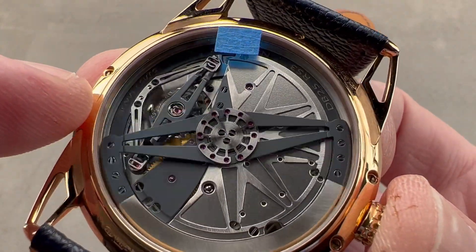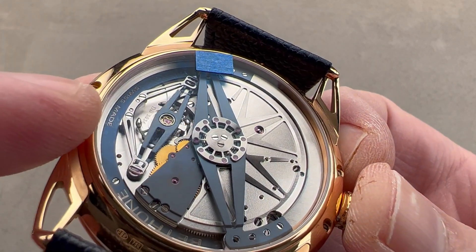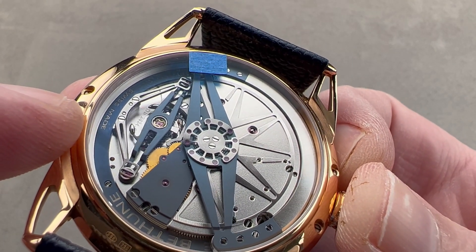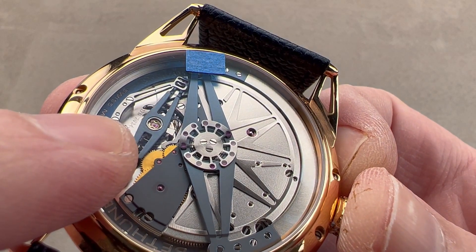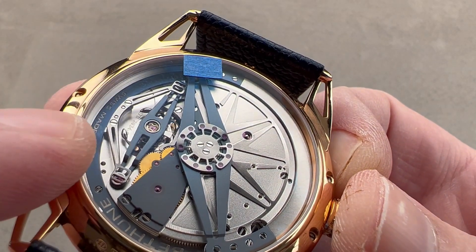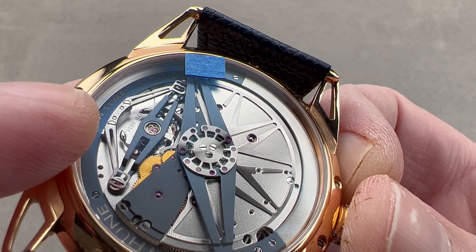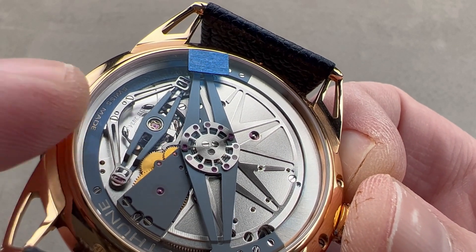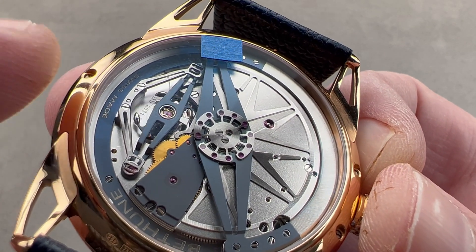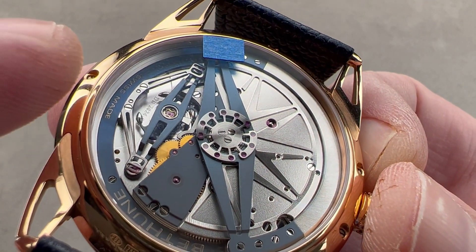We have more of the fired blue titanium on the reverse side. We have three shock protection springs on the balance — that's called triple parachute. It's there for the sake of chronometry as well as shock resistance. Most watches feature shock protection for durability alone, but here Denis recognizes that the faster you can reseat the balance staff pivot in its jewel cup, the faster the watch may resume keeping good time. So this is here to rapidly recenter the balance staff, not just to protect the pivots from fracturing. We have a patented balance design shaped like two overlaid yokes — cruciform, non-annular. It features a combination of blue titanium with platinum bulb masses. The idea is to put as much of the mass as possible in the rim of the balance for efficiency and chronometry, as well as to limit the effects of aerodynamics and temperature on the timing of the watch.